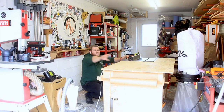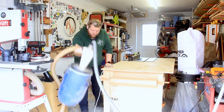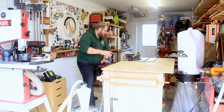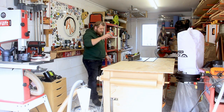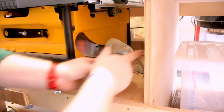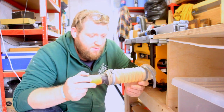Table saw next. My current extraction was this lovely dust extractor, which I would plug into the connection here. Now this works perfectly fine — actually no, that's a lie. It doesn't work at all. There are some massive bottlenecks and half of the time it's completely locked. So I think I'm going to take off my current dust extraction connection and re-feed it to the other side of the workbench so I can plug in from that side. You would have seen me do this on a vlog a while ago where I connected this right angle joint onto the back with a tiny bit of hose.